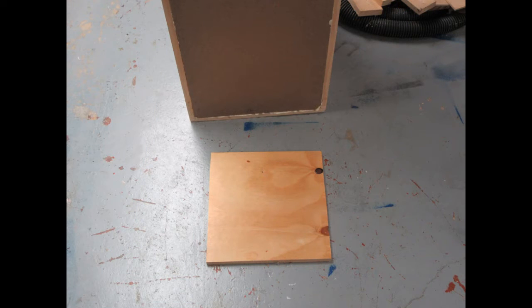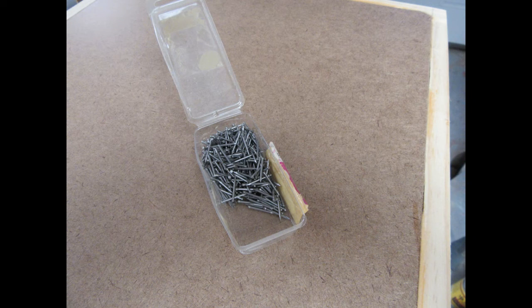In preparation for gluing the end panels, I put some sort of a riser on the floor. This is to provide a platform on which to rest the bottom panel without the frame itself resting on the floor, and to prevent any seeping foam from gluing the frame to the floor. If long enough beam clamps are available, they can be used just as with the other sides, but for this particular case I did not have the correct beam clamps, and therefore it was difficult to adequately press the end panels into the inlay areas.